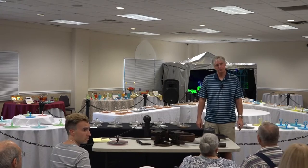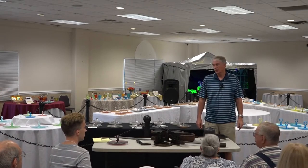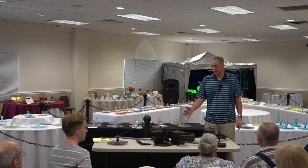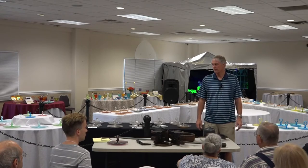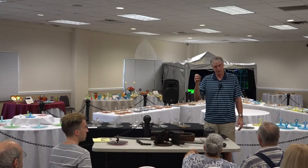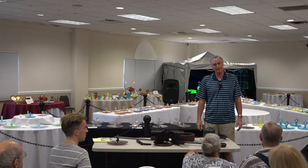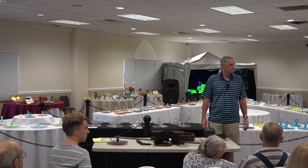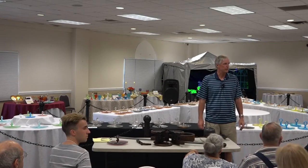When you pour the glass into the mold, approximately how long do you leave it before you open the mold up? Well, you saw them there, it was just a couple of seconds. On a piece like this, it's going to set up pretty quickly. You pull the lever and set the piece with pressure. I'm trying to remember back to the video, less than 5 seconds, two or three maybe. If they don't take it out right away, it sticks, correct? It can, yes. It can shrink on the plunger and stick, or it could get too hot and stick.